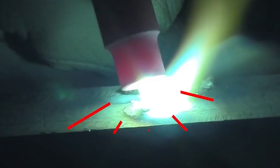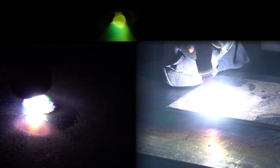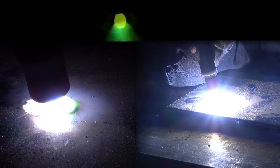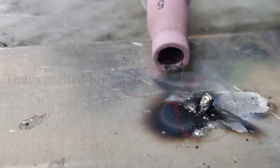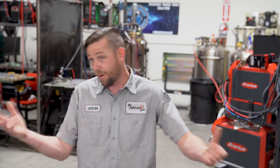You've got to get rid of the oxide layer. So if we went electrode positive, consider that your entire work surface is electrified and all of that current is trying to get up into the tungsten — basically a big powerful fist trying to blow it away. It's very intense on the tungsten, but it does get hot enough to melt the oxide layer away, which is partially why we need it.